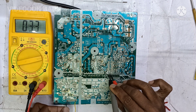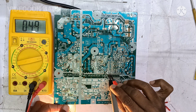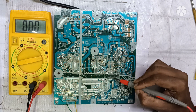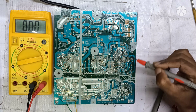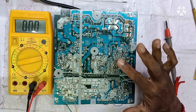Now I am going to load the bulb on the 24 volt secondary side and check the variation on optocoupler primary side pins three and four. Under load, pin four reads 4.9 volt. This 4.9 volt is connected to the PWM controller IC feedback pin. Without load the meter reads 3.3 volt; with load it reads 4.9 volt. So the secondary side error amplifier is working good and the feedback voltage is being passed positively through the optocoupler from secondary to primary.